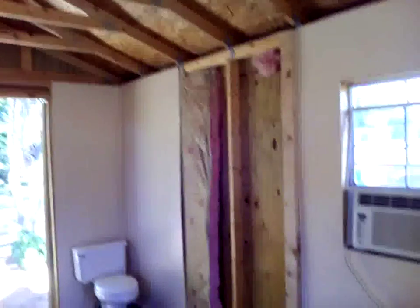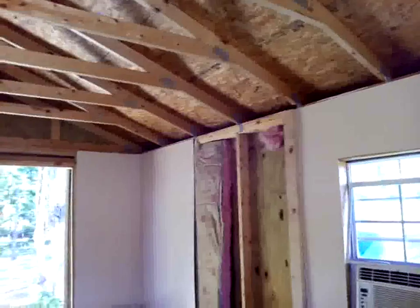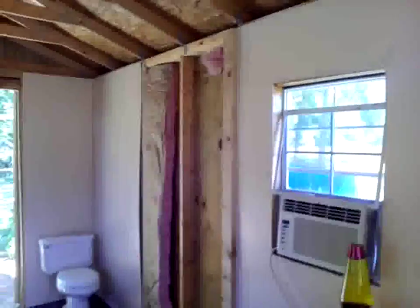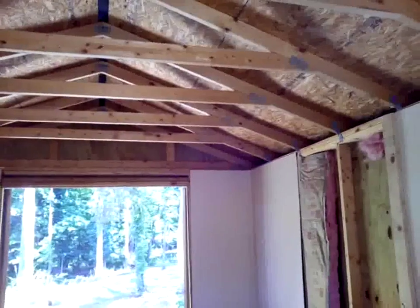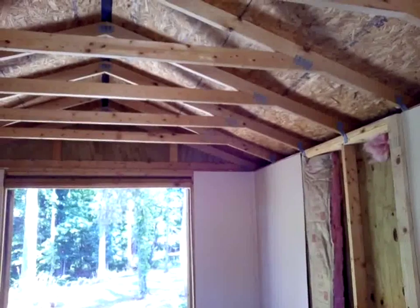So I'm looking at what the length of my stud is going to be, only to find that this is a tray ceiling, and you see that this ceiling goes up and then over a little bit out as far as my wall is going to be. Since these are 8-foot stud walls at the exterior, that rise puts these at 107 inches is what my stud needs to be. Well, I bought 8-foot studs, which are 96 inches.